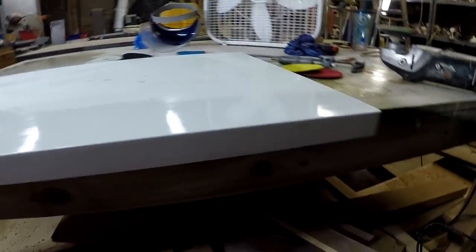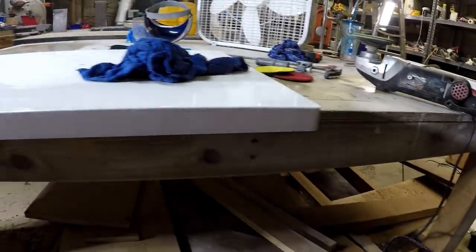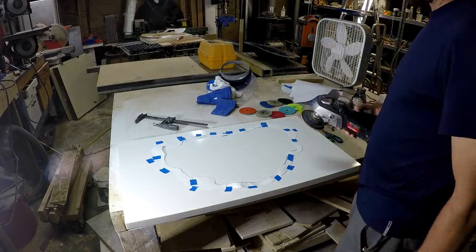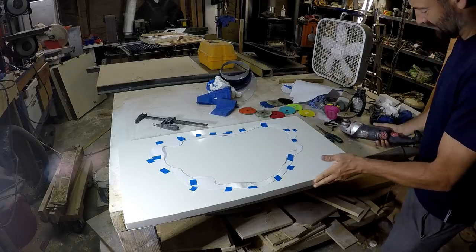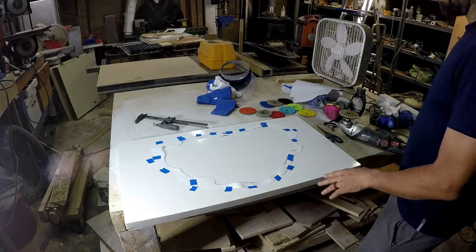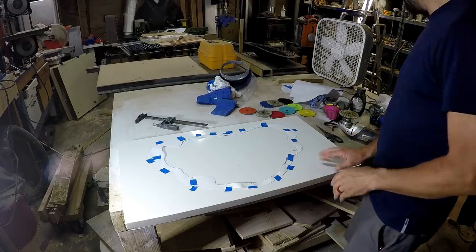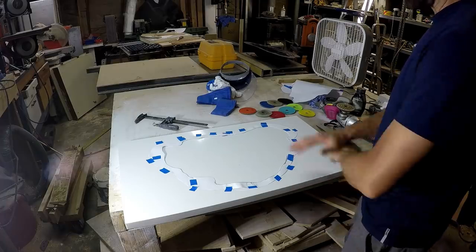This is the first time I've ever worked with a quartz slab. I've done some work with granite slabs and this seems to be polishing a lot faster and easier — of course it's not a natural stone, it's man-made. I stopped polishing because it's super smooth and staying perfect, but no matter what RPM I ran or how much water I had flowing, the color of the disc was sticking or staining the face of the quartz. I've ordered some new discs that should be here Friday. Proof of concept: the side is as smooth as the top, and I'm really curious how the new discs will perform.